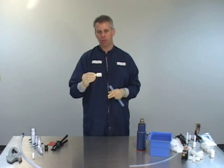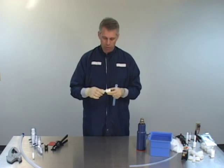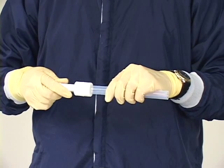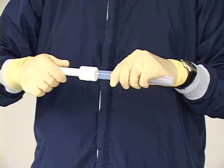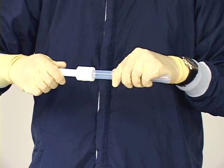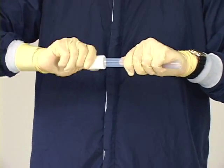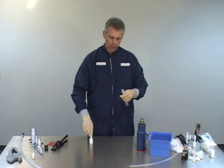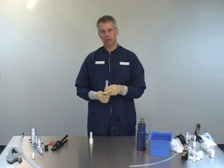To do this we're going to require the groove tool — the white tool, not the blue one. There's a small arrow on here which points in the direction we're going to be turning the tool. To do the grooving process, depress the thumb rest and insert it all the way onto the end of the tube. Turn it three to four complete revolutions, also pushing axially along the tube while doing that. Depress the thumb rest and pull it off — and there you'll see we've created the groove for the locking ring. This process is done prior to actually flaring the tube.